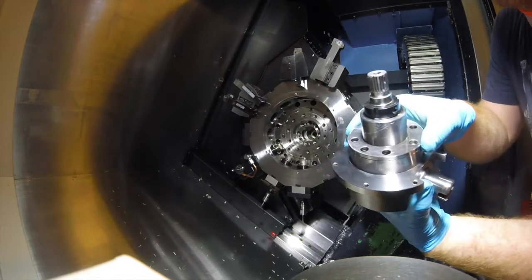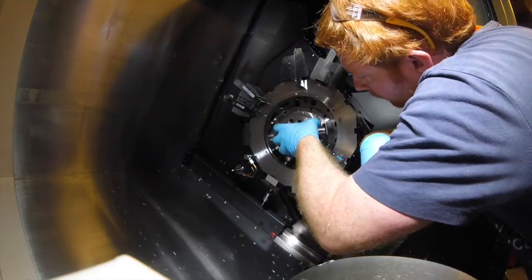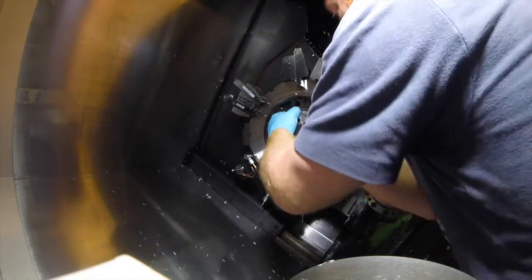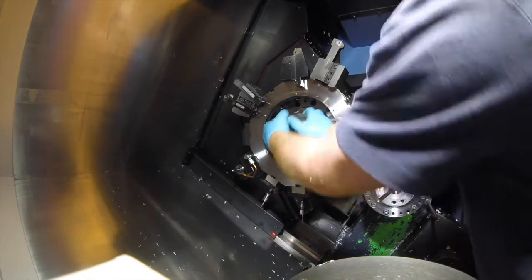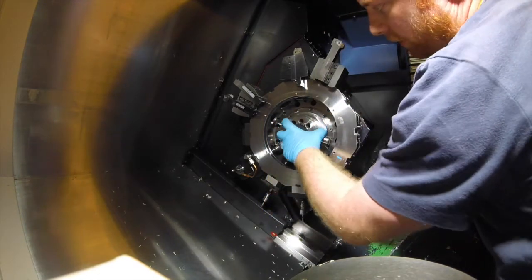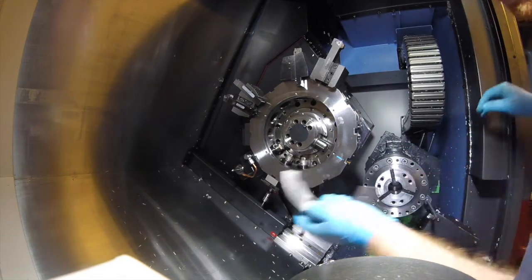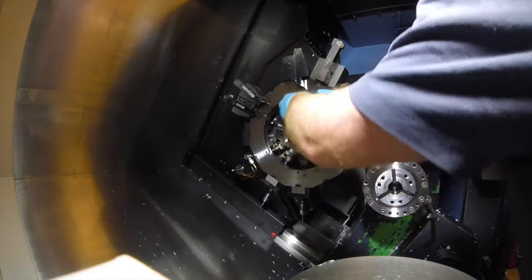Make sure this little plate at the back is all aligned so all your six holes are pointing in the right direction, then slide it in carefully — it should just glide in; it's a really precision-type fit. Once in, it just slides in and spins around. Make sure it's aligned so this points towards the tool directly in line with the centreline of the turret. Then you've got to put these little quadrant plates on — the little notch sits at the top. To fit the second one, just spin it around and put it on while it's upside down, then spin it back.